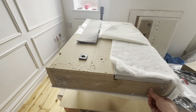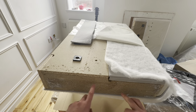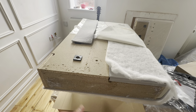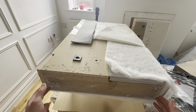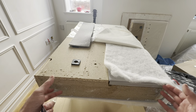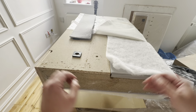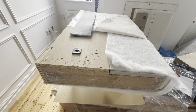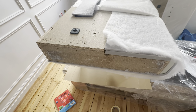That's the other thing. Don't ever be too hasty or aggressive with the hacking and pulling bits off, because the more panels we can use as is, not only does it save on cost, but because these are factory cut, they'll be parallel, they'll be square, and if we can reuse them as they are, it'll ensure that the new end of the arm remains square, which is very important. One, for aesthetics, and two, for structural integrity, which is always nice. We do like integrity on this channel.